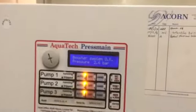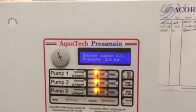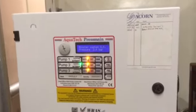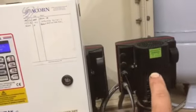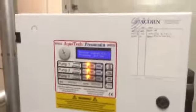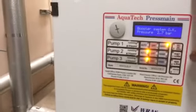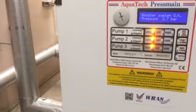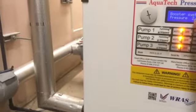You need to press the green on button again to actually get it back to run. Starting to run now — running auto. System pressure 2.5 bar. You can see how, even from just a two-second shutdown, how much trouble it had restarting. We had to reset this, switch these back on behind, and then once this brain had worked it out, we needed to switch these on again. We're up to 2.7 bar and I would assume it's working correctly because it's come up to its main working pressure.